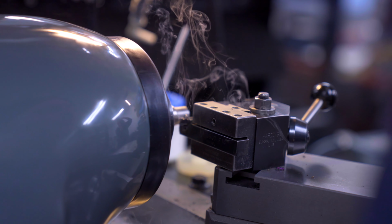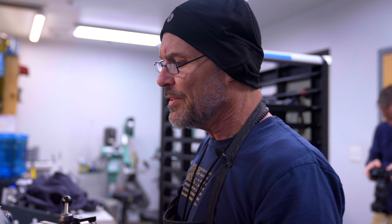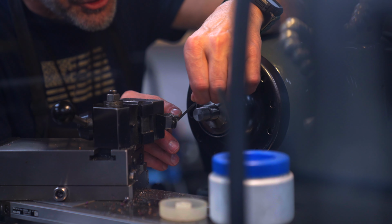As you get closer to your major or your minor diameter, you want to be taking a lot less. Typically, if I'm cutting threads with precision, instead of using ring gauges, mostly I'll use a set of micrometers that are designed to check the pitch diameter on the actual diameter itself. So it'll check the bottom, the crest, and everything else. Thread mics are the best way to go because you can get within your nominals very, very easily. It's easy to make a mistake and overdo it. Just knock any burrs at the back of the shoulder off a little bit by hand with a very, very, very precise file.